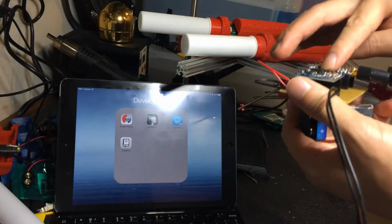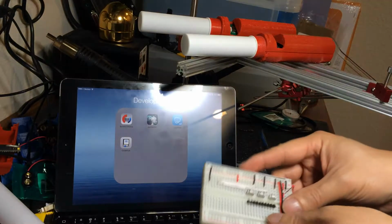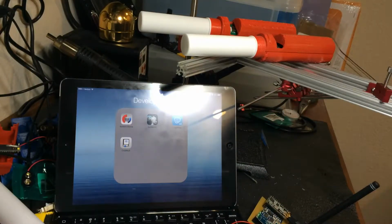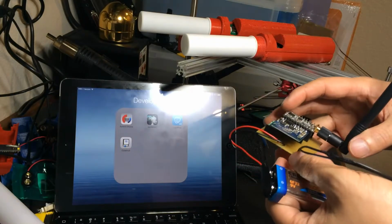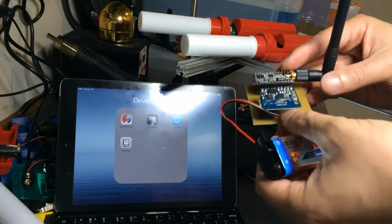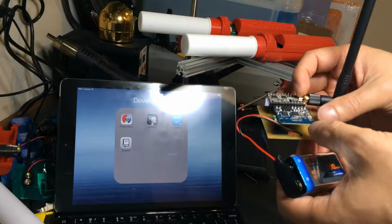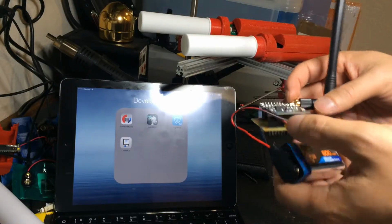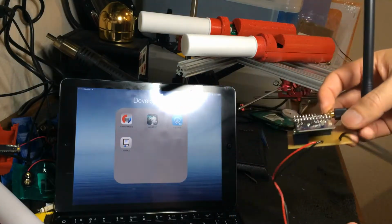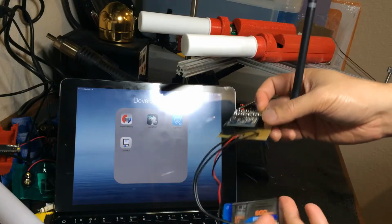And with the Bluetooth LE, I no longer have to worry about futzing around with switches and updating the Arduino code for switches like I had in the previous board here. Instead, I can focus on software-based controllers in an app development environment, and then you could tuck this in a bag or under the seat. The range of the Bluetooth LE is pretty good, right? If it's under the seat you're sitting on, or if it's in your pocket or something, clipped to your waist, it's totally close enough to meet your iPhone or Android device. And so to demonstrate today, I'm going to turn it on with this power switch.